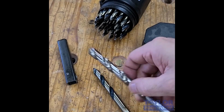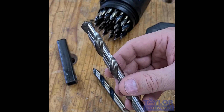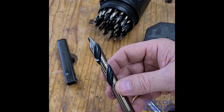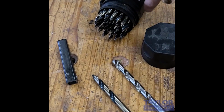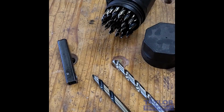And if you've ever tried to enlarge a hole with a regular twist drill bit like this, you know what I'm talking about because it can be quite exciting. They're also good for drilling thinner material and hardened steel. They can also work with wood — they're not bad with wood as well. They come in sizes all the way from sixteenth-inch up to one inch, so there's a bunch of sizes available.